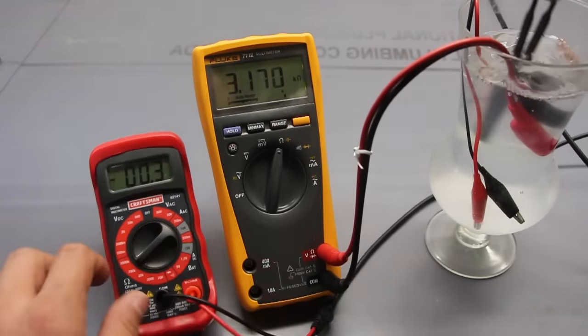So I'm going to turn it on. Notice not an issue so far. And what we're looking to do, again, is measure current, and keep in mind this is fairly dangerous. I do have live current. There's another live, so I have to be very careful. Those two are close, although they're separated. So just be cautious. Here we go. There we go. So right now, it's measuring 6.73 amps.